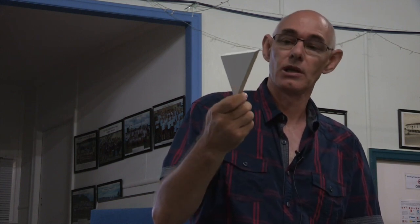Melamine is cheap, UV resistant, and easy to process, and heat resistant. So that's why it's crinkly, because melamine's quite a brittle material. So over time, it gets crinkly and cracks and softens out, lets the air through so it doesn't behave as well and it loses stiffness. And there are companies in the States and Singapore who'll take your old sail, vacuum clean it, strip the resin off, put more resin in, send your sail back, looks like new. So that's going to happen more and more.